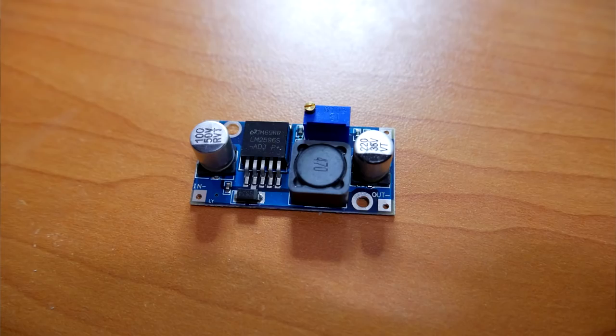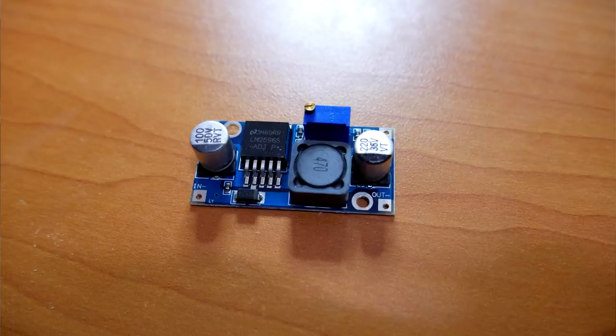We're going to use these simple little things called buck converters. A buck converter is simply a colloquial name for a voltage regulator. These ones I'm using are adjustable and extremely cheap. They're capable of supplying 3 amps reliably, which is great because a typical Raspberry Pi is meant to draw up to 2.5 amps. There are some other ingredients here — individually they're all quite cheap, and the links to them are all in the description.